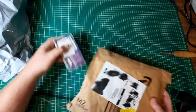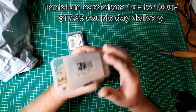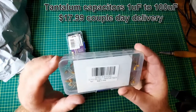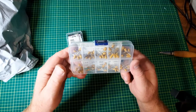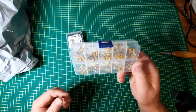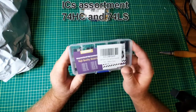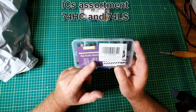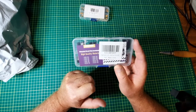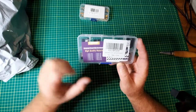It rattles — there should be some tantalum capacitors in here. They put the label in okay, but tantalum capacitors have almost none left, so I figured I might as well pick some up, mainly to beef up the order a tiny bit to get the free shipping from Amazon. In here we also have some integrated circuits — 74HC hex inverters to get the Colpitts oscillator working, maybe up to 20 megahertz.